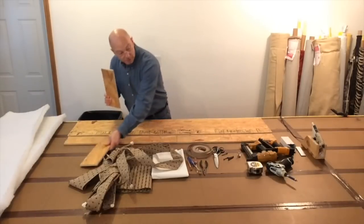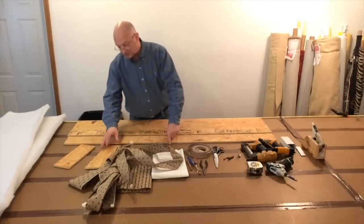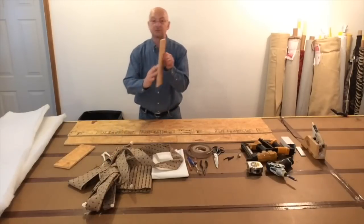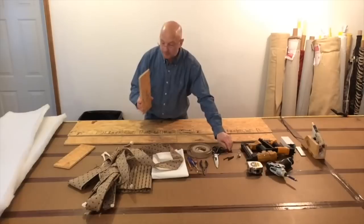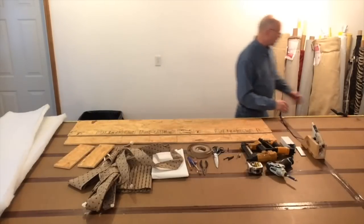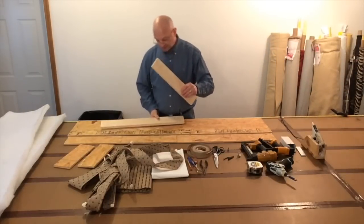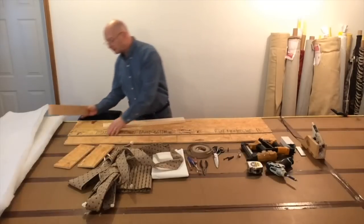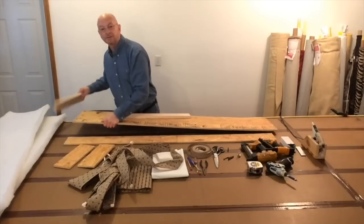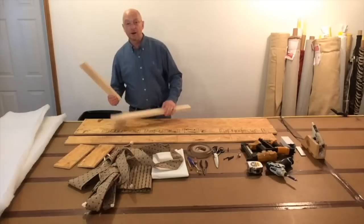And if you're not using an air staple gun, it is very difficult when I put this together to use standard screws going through these, since the walls of these are so small. So you can replace the dust board and the two returns with just standard pine, because you've got 3/4 of an inch. So it makes it a little easier when you're putting this on and you can screw right into the pine. So remember that you don't have to use the OSB board, you can use pine.